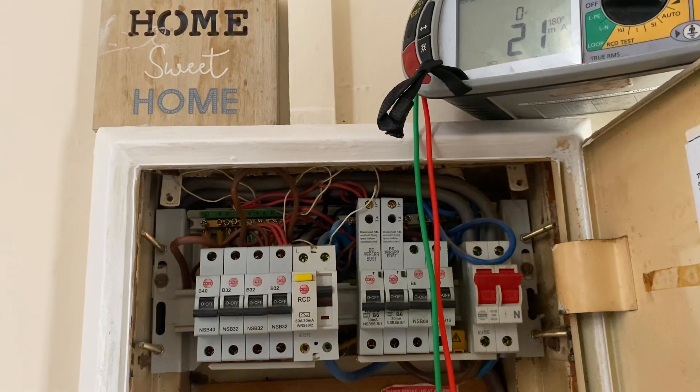If this comes to, say, 13 milliamps, you might think that's still not too much of an issue. But let's say we've used that 30 percent — nine milliamps of natural earth leakage — when everything is turned on. That means the RCD already has nine milliamps of earth leakage it's detecting. If it's tripping at about 13 milliamps, it's right on the edge, only needing another four milliamps before it disconnects. We have to look at the whole installation.